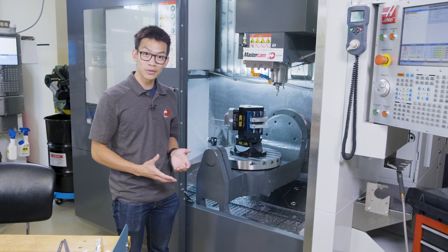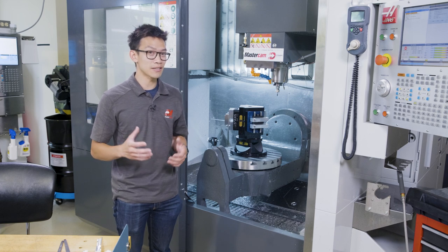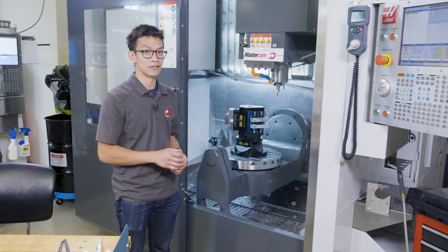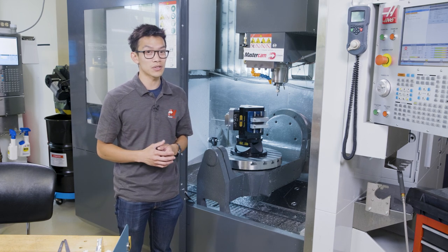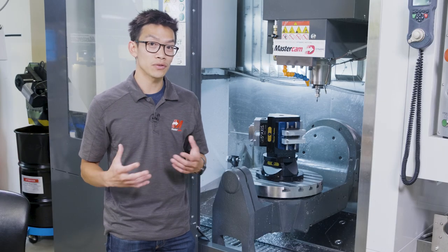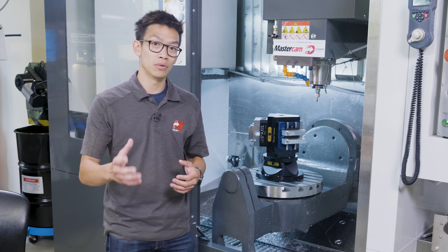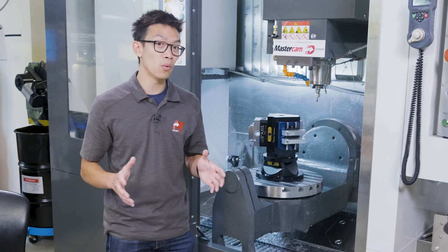Being able to use multiple setups and cut 2 parts at once now brings the average cycle time to less than 50% of the single 5-axis setup and almost 75% reduction from using a 3-axis machine. In the next video, Jesse will be going in depth about using stock models to machine parts accurately and really be confident that you are removing the material that you want with no wasted motion.